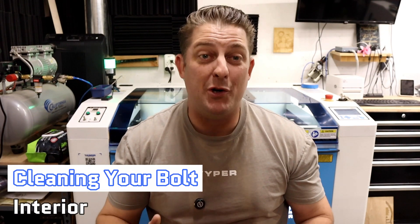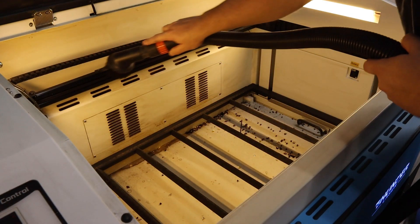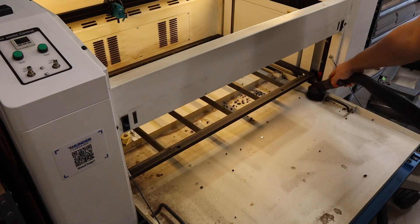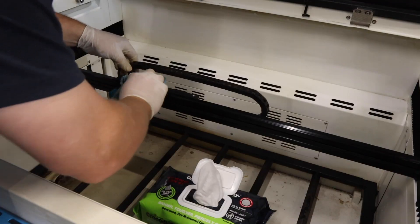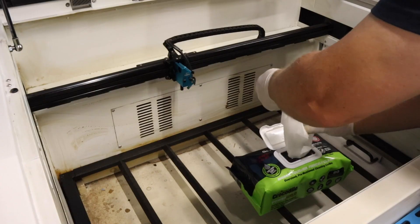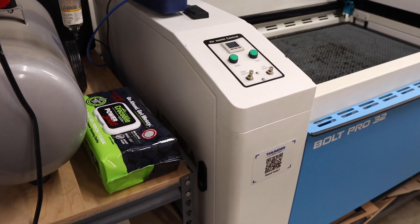For the remainder of the steps, I recommend turning off your machine and leaving it unplugged, just to be safe. I start by using a vacuum with a brush attachment to suck up any loose dust or debris, paying specific attention to the rails, belts, and crumb tray. Then I wipe down all of the interior surfaces to remove any resin or soot buildup. This takes a little time if you don't do it often, but with some work we'll turn these panels back to white from yellow. I do this with a combination of degreaser and paper towels, and I also really like using crocodile wipes from Home Depot — we keep a pack close to our lasers and wipe them down often.